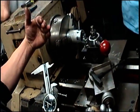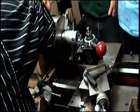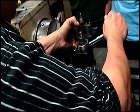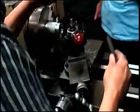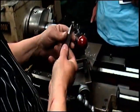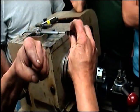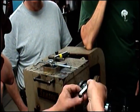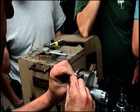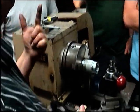The machine will do what you ask it to do if your tool is on center. My next tool is a left-handed tool. If you look at your right-handed tool, it is pointing to the right — if you hold it with the red dot facing you, it points to the right. Flip it over — I have a blue dot — it points to the left. Right is for turning; left is for facing.